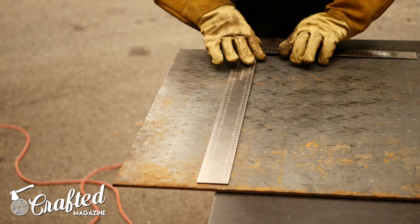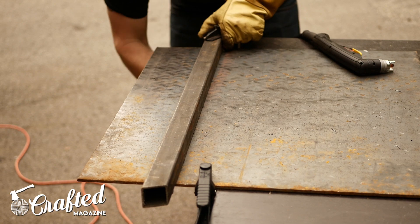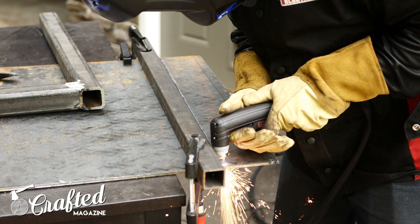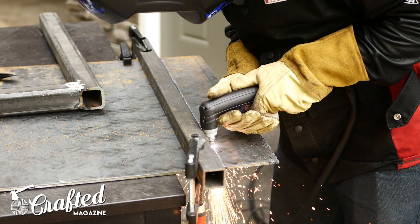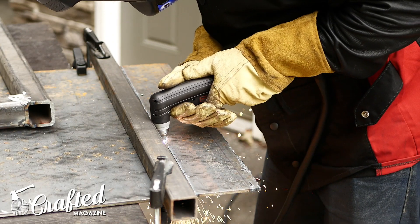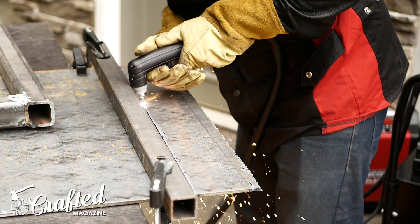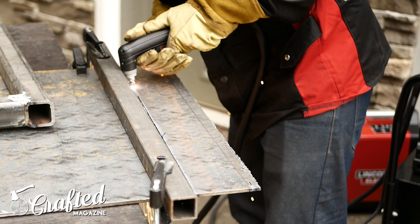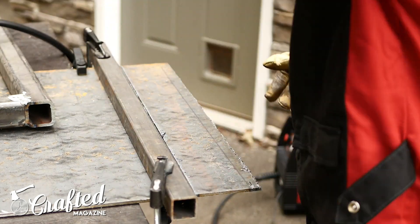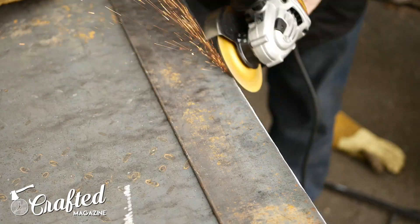Next, I needed to cut off a few pieces from a large piece of quarter inch thick diamond plate steel that I also found at the scrapyard. These pieces would make up the mounting plates that the legs attach to, which are used to attach the legs to the plywood desktop. I cut two pieces roughly four inches wide by 24 inches long using a plasma cutter, though you could just as easily use a cutoff wheel on an angle grinder. This was only my second time ever using a plasma cutter. Off camera, I also removed about two inches from the overall length of each mounting plate, bringing them down to roughly 22 inches long. Afterward, I ground down the dross left from the plasma cutting using the same grinding wheel.